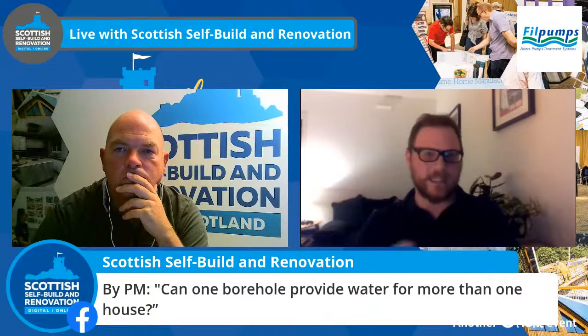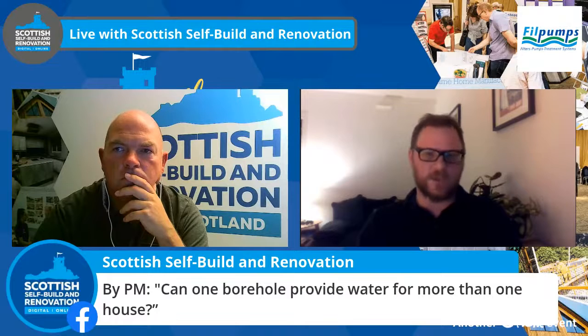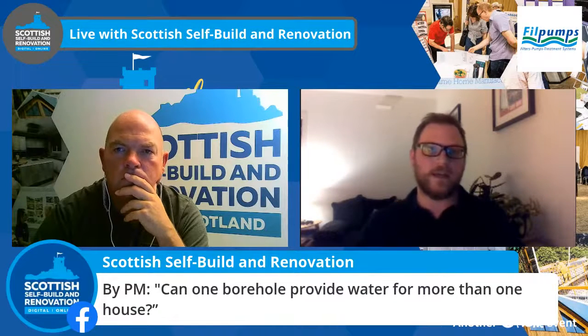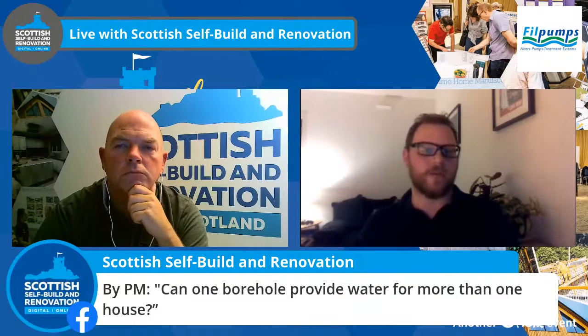And so, linked into what you've just been saying, very common problems, even with experienced architects, say that we've sometimes gone out to sites and like we said, people are very enthusiastic and they crack on with the house build, they get us out and it's like, right, as we've said, you want us to make use of this water source. Well, first of all, have you done a yield test yet on the well or the spring, or even if there's a pre-existing borehole? And if not, it might be that it just can't provide the water, even in a 24-hour period, particularly with wells. In which case, well, you built this house, you now haven't got a water source. What are you going to do?